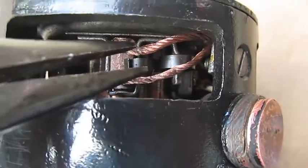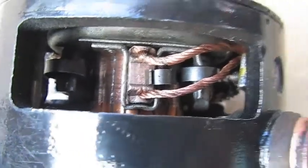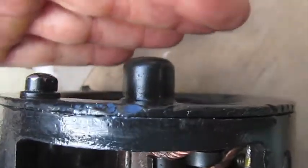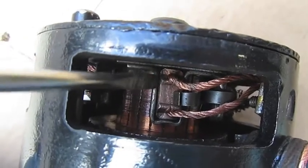As you're moving things around when they're loose, I occasionally used needle nose pliers to slightly position a shoe by grabbing one of the copper strands — but don't pull hard, or you'll have even more problems. I was able to use the flat head of the screwdriver when the plate is off. You can rotate around and get into the open area when the band is off, and use the screwdriver to guide each of the four shoes or brushes onto the copper commutator, but not all the way at first.